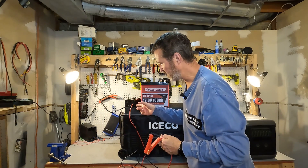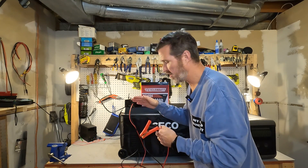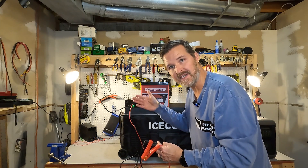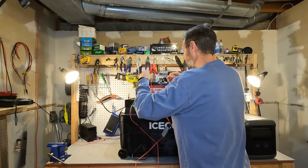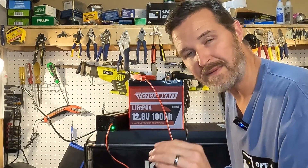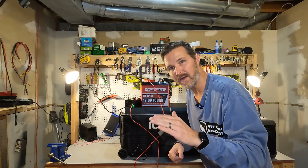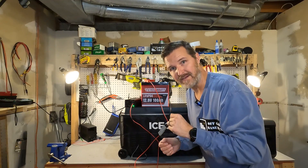The charger is flashing green, meaning it's on standby. Once I connect it, it should go solid red, but only stay red for one to two seconds — then go solid green because the battery told it to shut off. Connecting now: solid red... and solid green. Perfect — that is exactly what you want when your battery has low temperature charging protection. The cooler was set at 30 degrees Fahrenheit, which is as close as I want to get to that 32 degree cutoff.